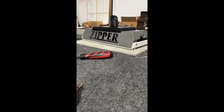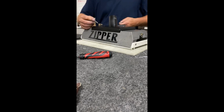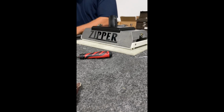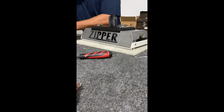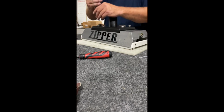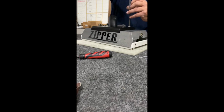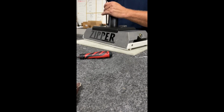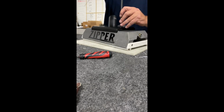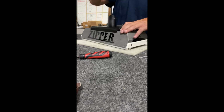I have his head here. I'm going to finish putting the bolts in the lid, and I'm waiting for my paint to dry for the weights. Same screws, I just cleaned them up a little bit, and I'm dipping them in my anti-seize. Every bolt on here gets a little anti-seize. It'll save you a lot of trouble if you don't take care of it and you're not reapplying that, or not washing your machine, or lots of things can cause corrosion. So when I tighten these up, just like a tire, and I'm not cranking them, it's vacuum, it's not holding anything. I'm just getting it here, crisscross, and he'll get his weights in a minute.